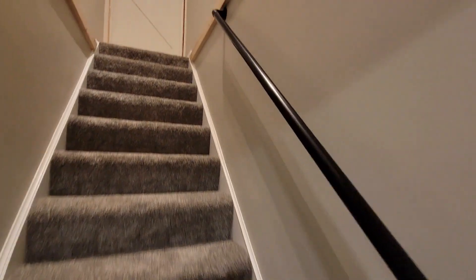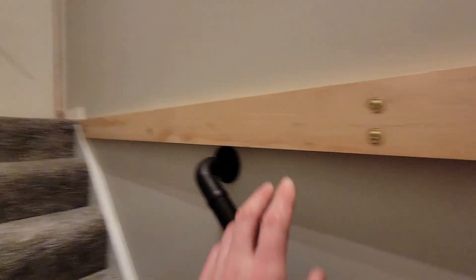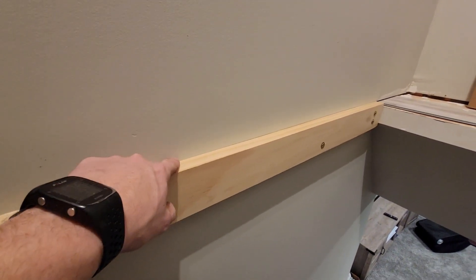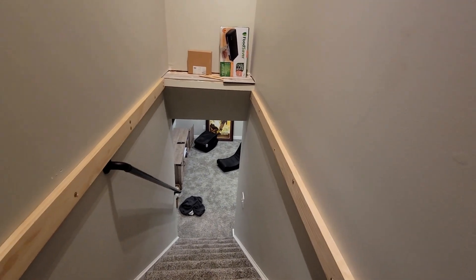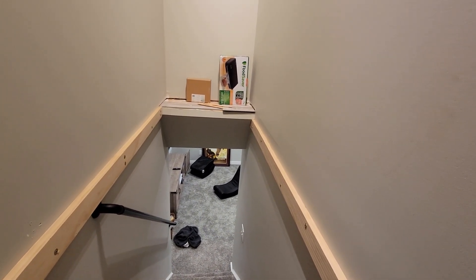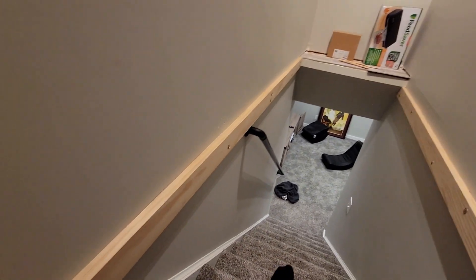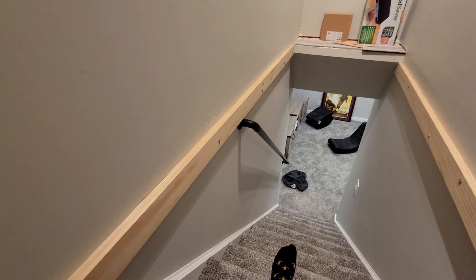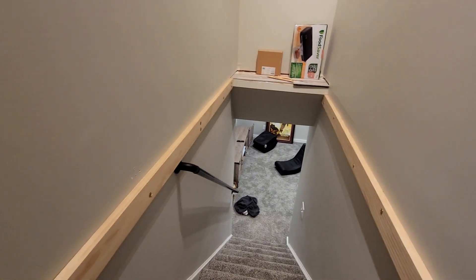I've reattached the railing and now I have two. This is going to be my nailer for my hinge — it's going to go all the way across. I was originally going to cut out the drywall here and set it back in, but I figured this is going to be easier in case we go to sell it — we can take this stuff off real easy. This is the one that the bottom platform will rest on. I haven't figured out quite yet if I'm going to go with a long piano hinge or like five door hinges.